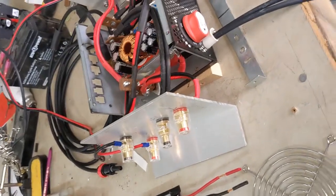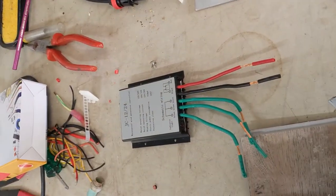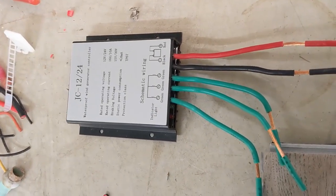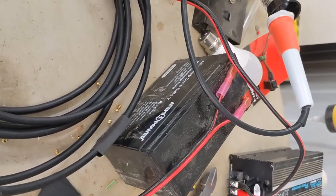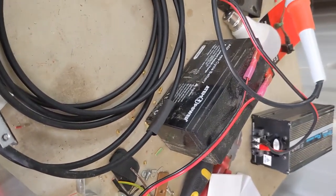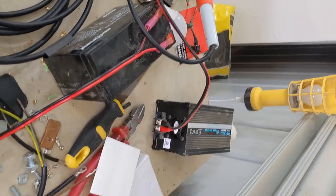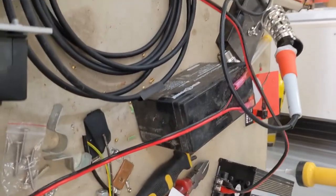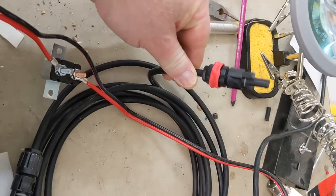Let's have a look at my prototype power system. What we're trying to do is take this wind generator — here's the charge controller for the wind generator — which is designed to charge a 12 volt battery. We have an AGM 9 amp hour prototype here, and the idea is to take that charge power and give it to our household grid tie inverter via these PV cables.